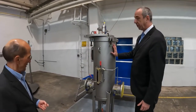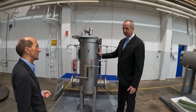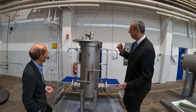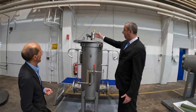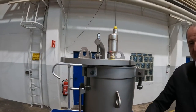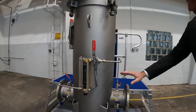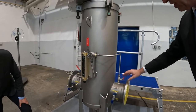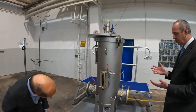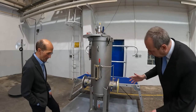That is something different — it looks like a vertical filter water separator, but it's a micro filter, a small micro filter. We're using four inch micro filter elements in here, which have an orange sealing. So the setup is completely different. But what is standard: we've still got the air eliminator, the safety valve, and the differential pressure. We use somebody else's gauge here to show that there is more than one manufacturer. We've got all the sample ports, the lining — all of that. So it is an EI 1596 compliant vessel and the elements are EI 1590 compliant — therefore we decided to have that.